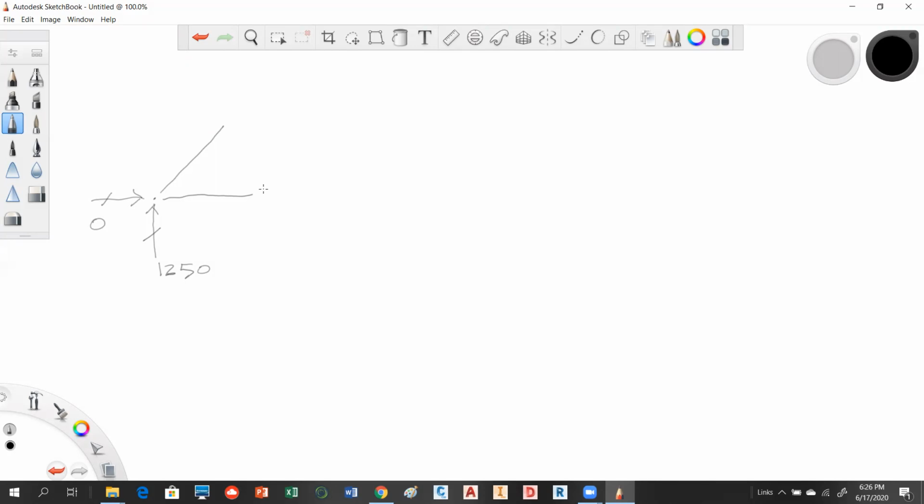It's arbitrary, but if you look at the diagonal, a lot of times you can tell this guy will have a horizontal and a vertical component. If this guy's going up, this guy's going to have to go down, which would indicate to me, as I look at this, that that is a compression member. So I'm going to call that AD. Now, if you do it wrong, you'll just get a negative sign for your answers, and you just roll with it. And as I look at this, I'm going to call this a tension member.